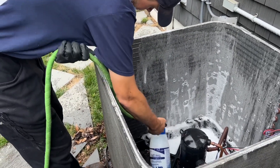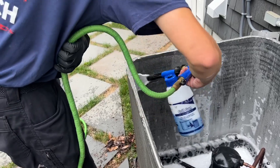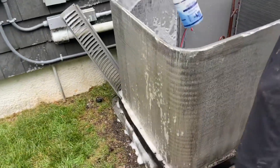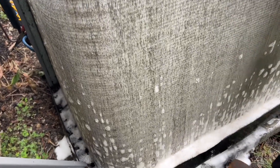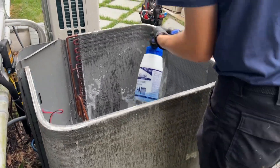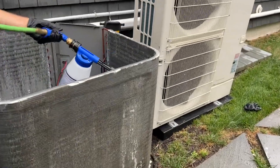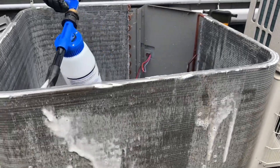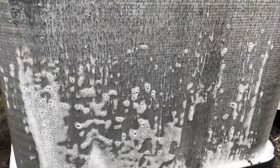When you put it on, you really have to move quick because you'll empty that whole container in about 30 seconds. Now Peter is working with the Refrigeration Technologies Viper brightener — he's already got one side and you can see it bubbling through the unit. It's bubbling and cleaning, restoring this coil to practically brand new. Look at that — very, very nice.